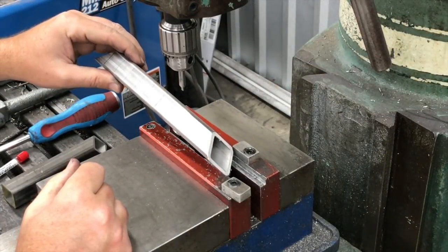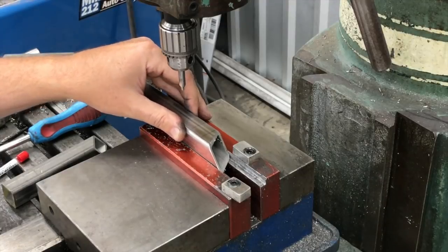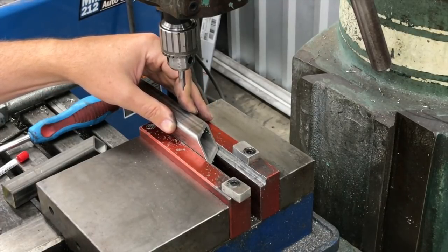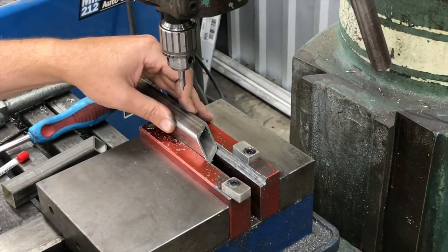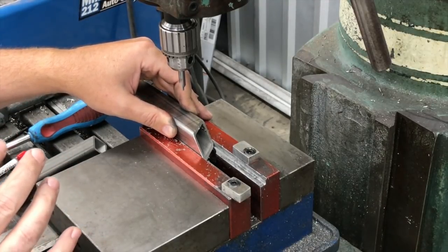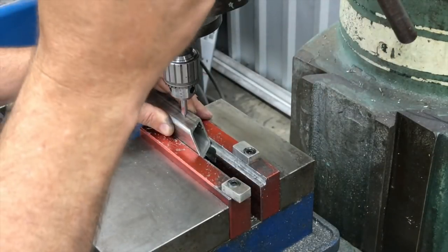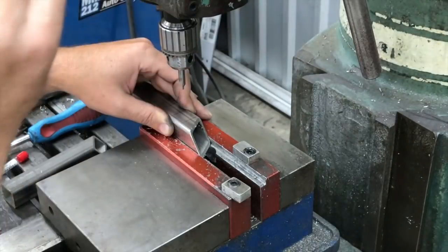Hopefully you can see that — we've got our lines evenly marked on here. I've got a carbide center drill in here and the vice is set up. I don't have it locked all the way in because this is kind of a production thing — I have 800 total holes with three different ops on them, so that's 2,400 operations. When you're doing that manually by yourself, you want to be as productive as you can. Perfect accuracy is not required here. In fact, what I'm doing is way more accurate than what they've been running in their production environment. I can't show more details — I'm under a disclosure agreement. So I just come down and eyeball it to hit the center point.